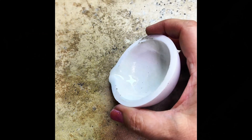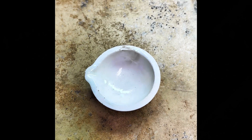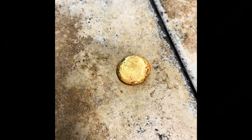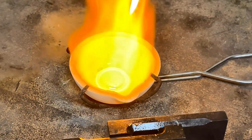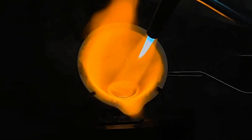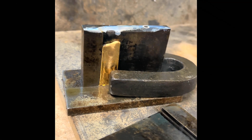So here is the shiny new crucible that we're going to use. As it's pickled, it's going back in there and then it's going in the ingot mold. Here's my gold — I got about 95% of the extra borax off of it. I'm not going to worry about every tiny molecule because there's going to be borax in the new crucible too. And it's just going to go into the new one, get heated up, and be made into a beautiful ingot. There's that same gold, all hot and jiggly in there — and there it is, all juicy and golden, ready for sheet.